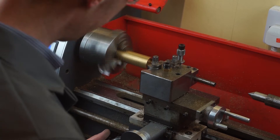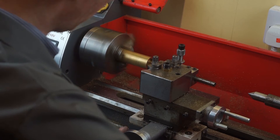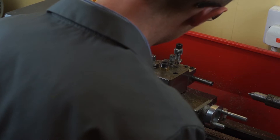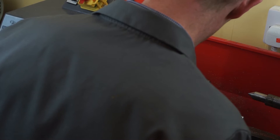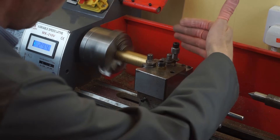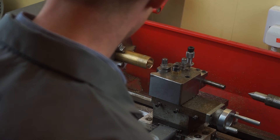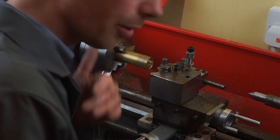We're now good to go. I'm going to get the lathe up to about 300 RPM and start to make a cut. Once I've established that the boring tool is going in okay, I can use the power feed to automatically feed the boring tool into the work. Once you finish the cut you always take the boring tool away from the material and then come out. I'm now able just to check my clearance — I can tell that we're going to have to take some more material off. It could take me five minutes or so — I'll do that before I show you the next stage.